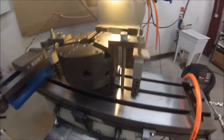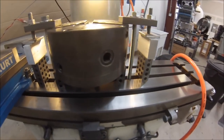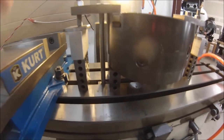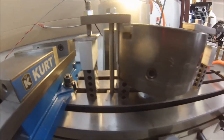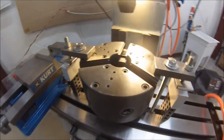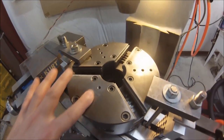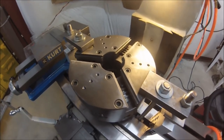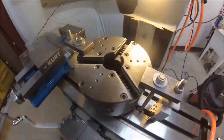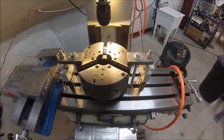The setup is pretty straightforward. The chuck is up on one, two, three blocks, with some tall threaded rod — all-thread, whatever you want to call it — and adjustable heels on them. I laid it out by eye. Critical alignment here is not required. Lay it out with a pen, a Sharpie marker, whatever — but drill your holes. Do not go through the front. Let's get this back over on the engine lathe and I'll show you what attaches to those holes.